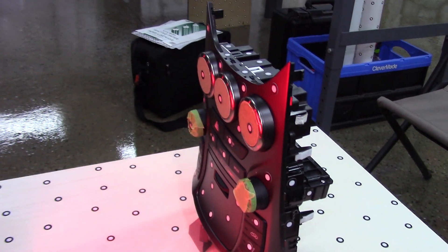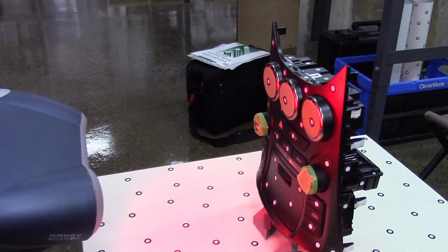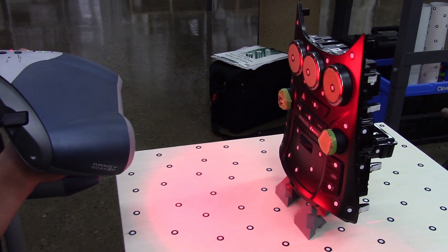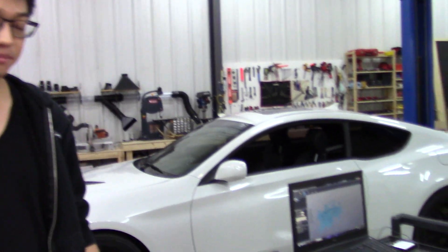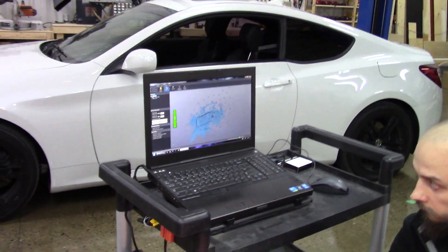Because these parts are fairly thin, it's important to position the part in a way where it's always tracked in depth, so the part is accurate and there's precision in the edges we need to capture. Throughout the scanning process we'll flip it over in different ways to orient the part so that the targets always optimize the surface we're scanning.